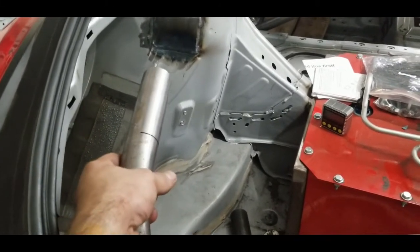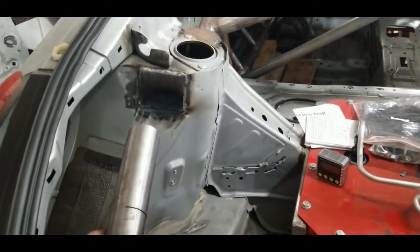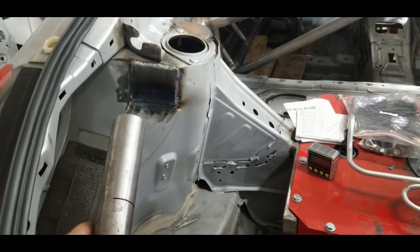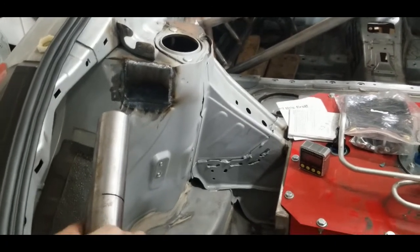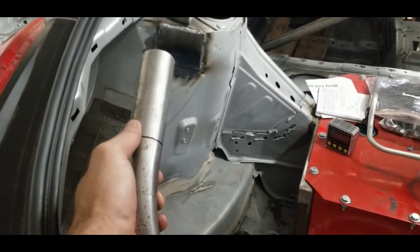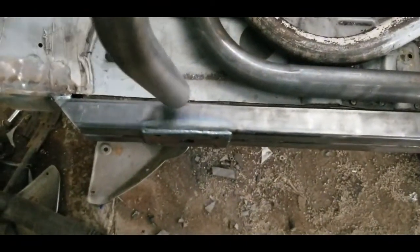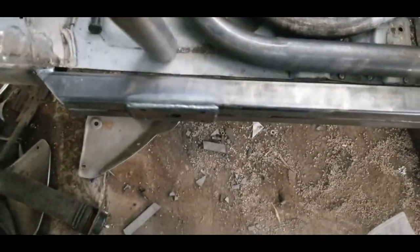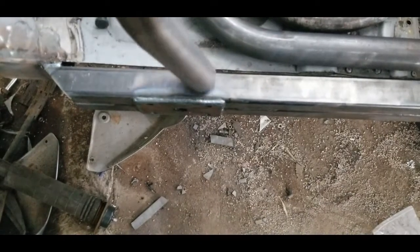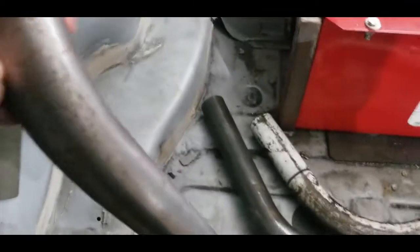What we're doing right now is we are going to roughly figure out the angle, and roughly figure out where the start of the bend is, because there's only going to be one bend in the rear tube here on either side, to kind of swoop it down from the shock tower down to the attachment point, which will be about right there. Most likely I'm going to make a plate that ties it into the floor right here. That way the pipe has a nice spot to land.